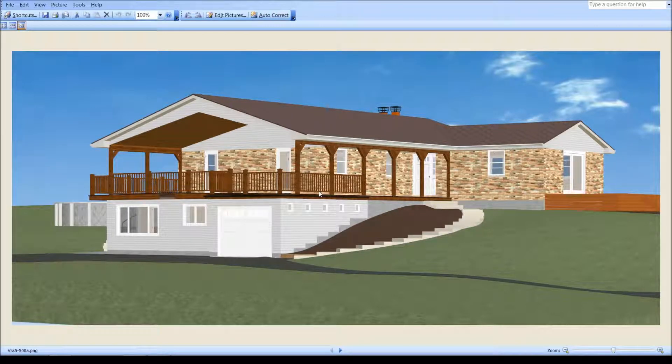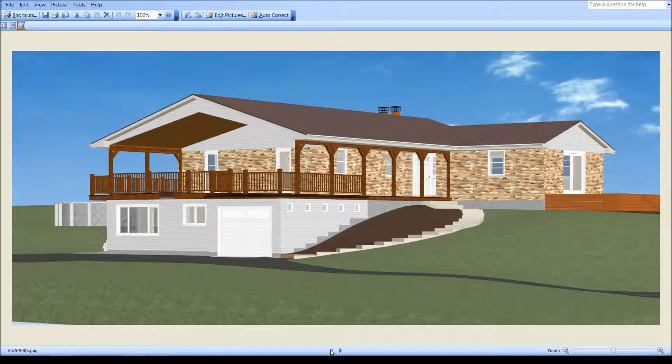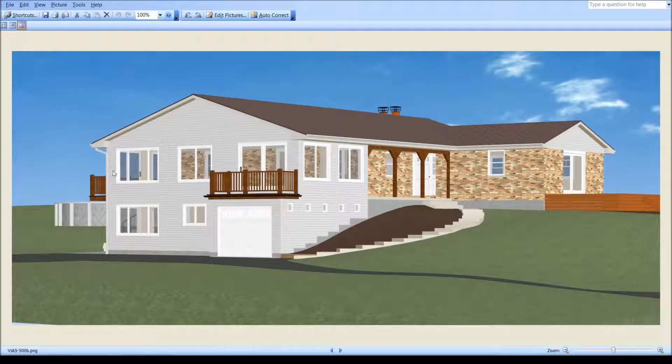In this permutation I haven't considered having glass up in here, because you're still going to have that raised cathedral ceiling inside. So I haven't done anything with the glass. These windows are probably about as large as we can go — we can come lower with them, but in terms of width they're going to require sections of wall between them and wind-braced panels.